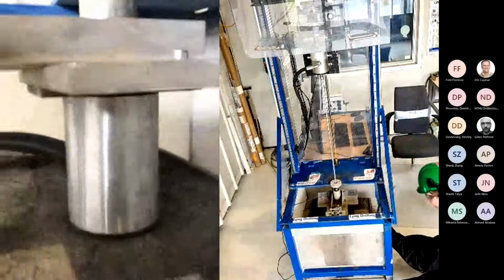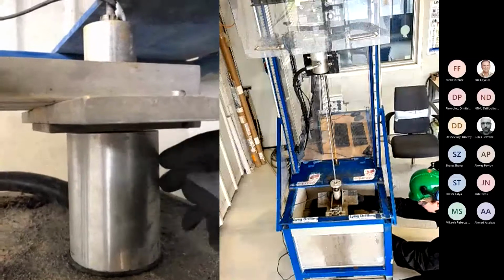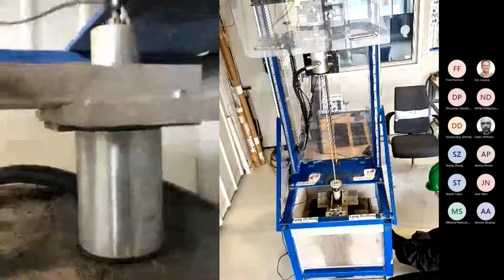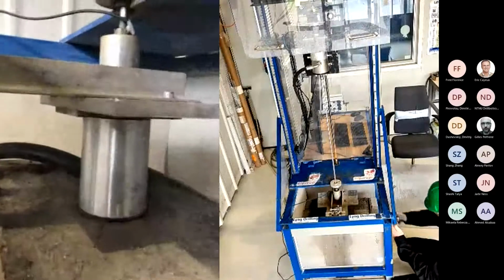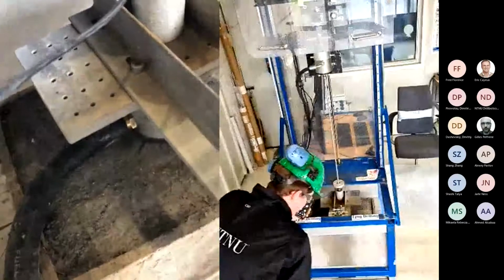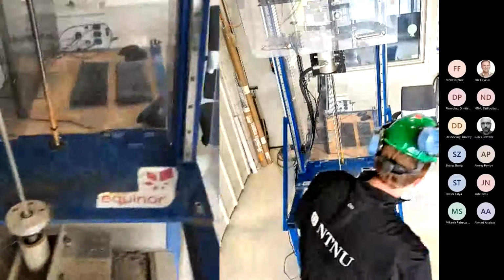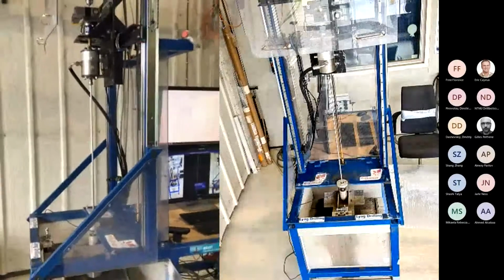We also have the BHA, which you cannot see now because it's covered with the diverter that we implemented this year. So the BHA is inside here. So unfortunately, you cannot see that live. We have already placed the rock inside the drilling cabinet here. The diverter is connected to a hose, which allows the cuttings to be diverted away in a safe manner, so it doesn't accumulate on the rock surface or on the floor. So that was a brief mechanical explanation of the rig. Are there any questions so far?